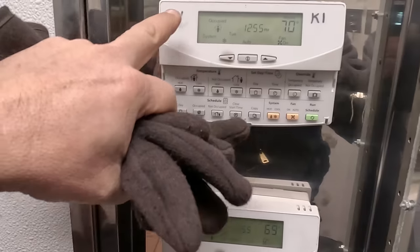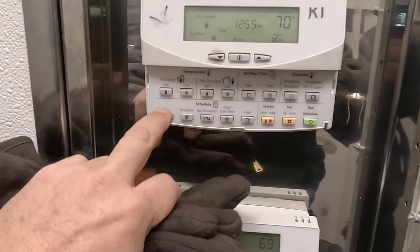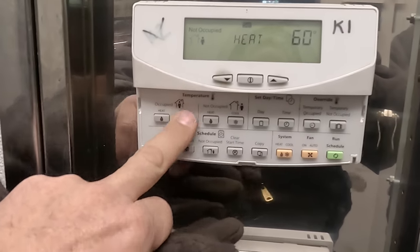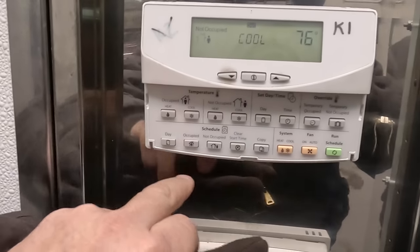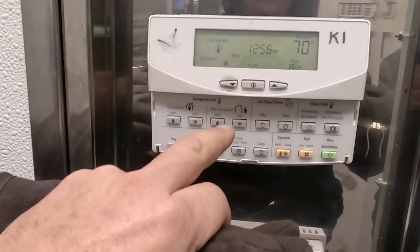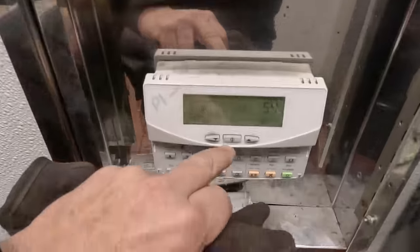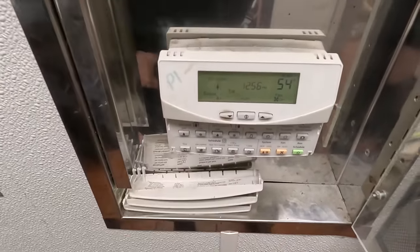So I just got a rundown on it. K1 here is the kitchen — it's now at 70, it's no longer acting up. We checked our occupied heat setpoint which is 68, unoccupied heat 60, cooling 74, and unoccupied 76. We went in and checked the scheduling — scheduling was fine. What's really wild is it was up to 80, it knew it was too hot, and then all of a sudden it started cooling. The play area here is 54 degrees. It knows it's not working right — it's calling for heat. Let's go up on the roof and see what we can find out.